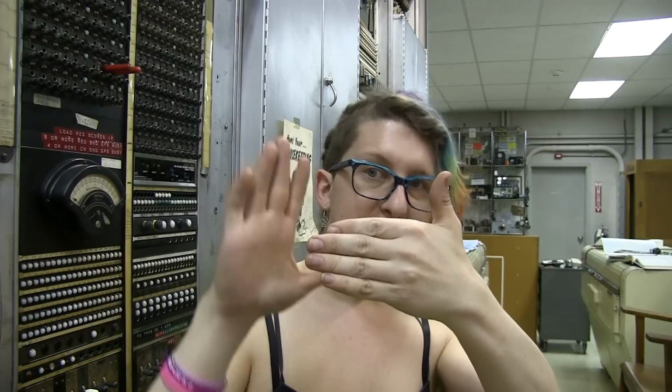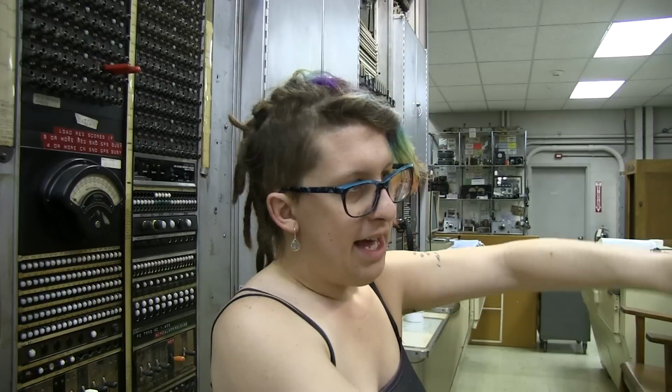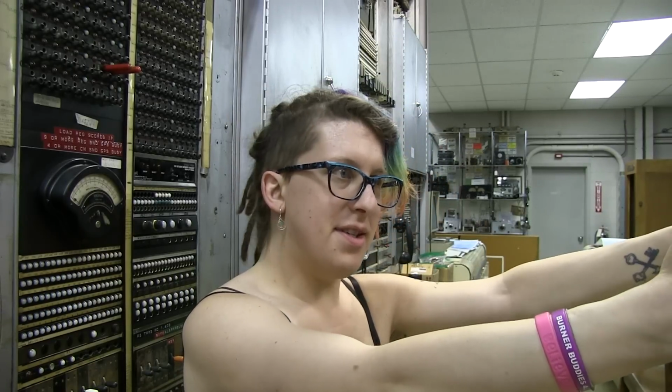Then it checks that, and if it succeeds, which it is, it operates a vertical select magnet and a horizontal select magnet and a vertical hold magnet to lock in the frame indication, and that's happening. Once it's locked in the frame indication, it goes ahead and does one final check to make sure everything is like it should be, and then it goes through a process to release the link frame and inform the subscriber end of things that it is ready to accept dial pulses: yes, you can close the tip and ring loop from the subscriber through me right now because I am good to go. And that's where this convergence is happening.